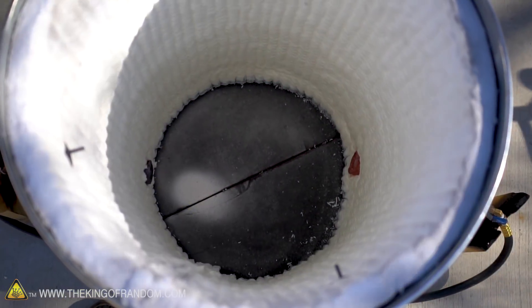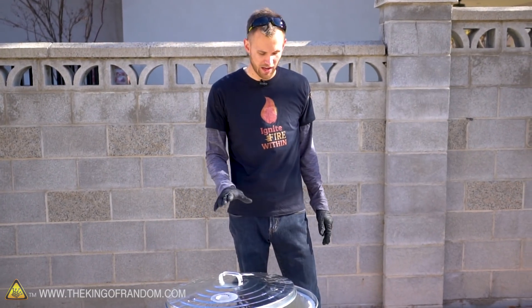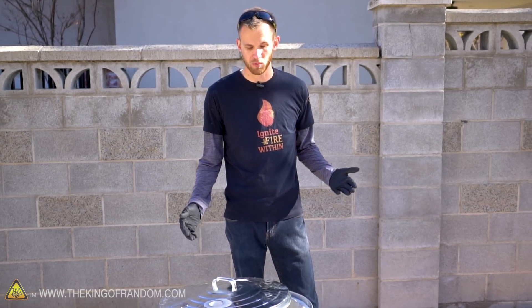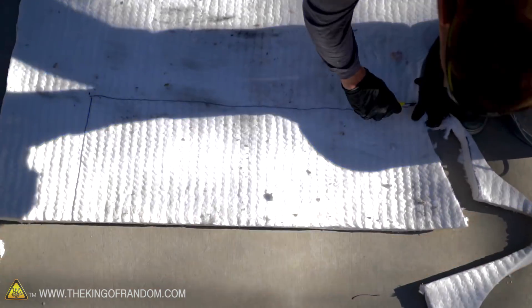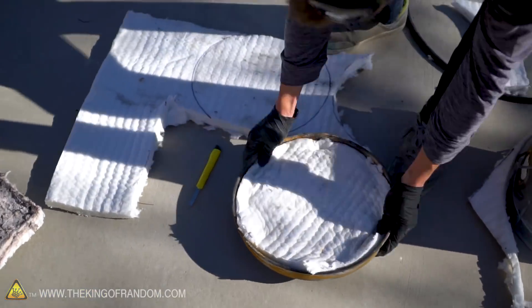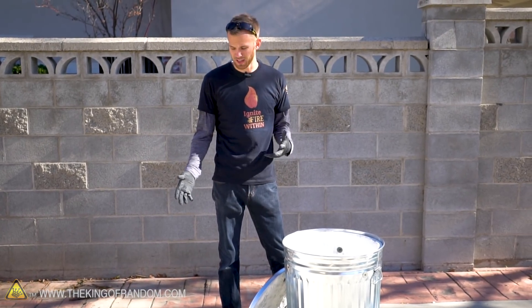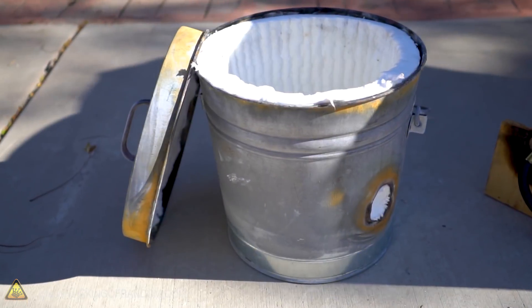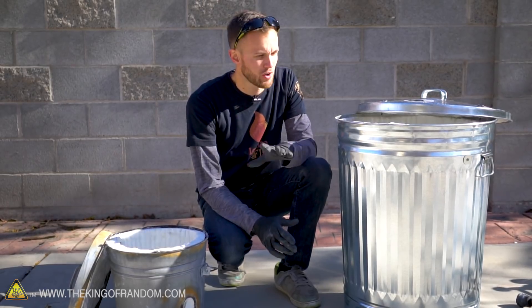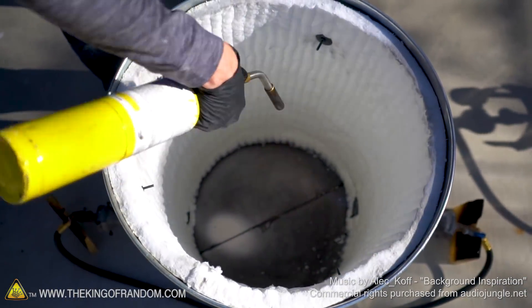There you go — that is how to make a large-scale backyard foundry. There are a few different things we're thinking of trying with this foundry. It's obviously much larger than our normal backyard foundry, which will let us do a few more things — we'll be able to fit a large crucible and we might also try firing some ceramics. I also took some leftover kaowool and relined the mini furnace, and I was impressed at how easy it is. It only took a couple of minutes to completely replace the lining. I'm really looking forward to trying out some experiments with our large foundry to see what it can really do. Thanks for joining us and we'll see you in the next one.